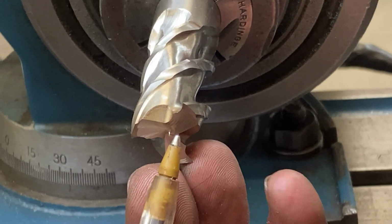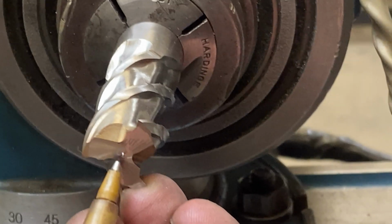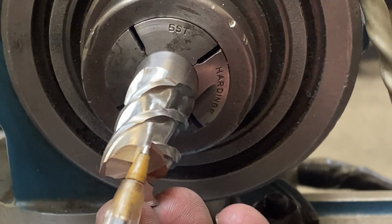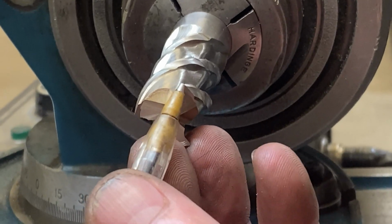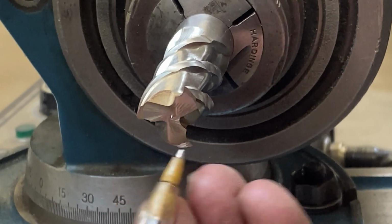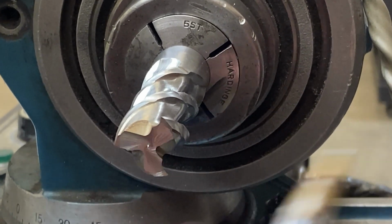Okay. So next we're going to make a setup that puts a notch, a tooth face, directly through the center of this little bump sticking out and right exactly to the edge of the tip, right at the cutting edge. So we want a straight ground line right from there to there that passes all the way through center, and that'll become the tooth that allows this thing to drill. The other two teeth are just going to get clearance knocked in them so that they're not interfering.